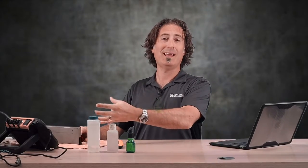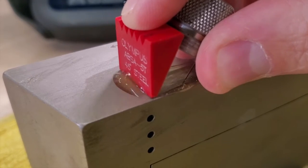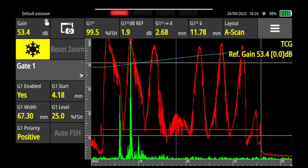Because most couplants doesn't mean all couplants, and the codes have to accommodate for this. There are some special-purpose high-acoustic impedance couplants that may make a little bit of a difference. For a DIY example, we'll use honey — it has an acoustic impedance of about 3 mega rayl, or double what these have, and it does make a little bit of a difference: about 2 decibels.